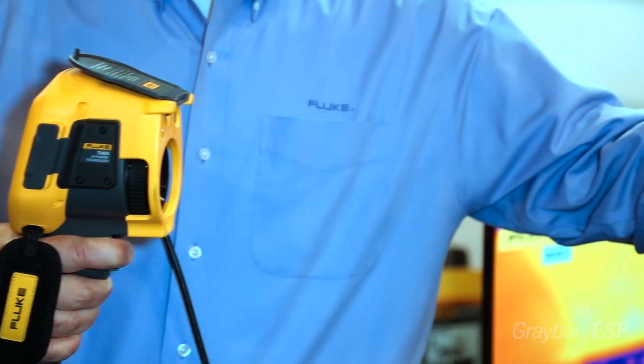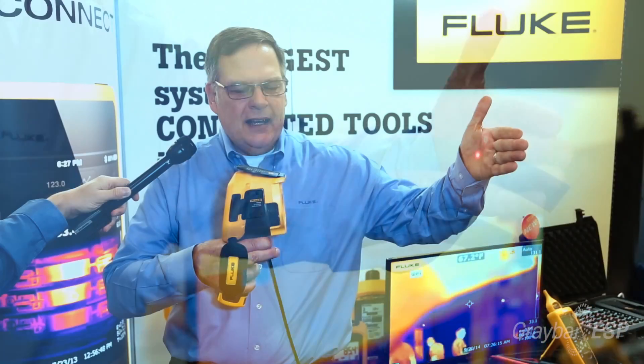With the TI-400, there's a brand new feature called laser sharp autofocus. There's actually a laser distance meter built into the camera. I can shine this on my hand and we'll get a perfectly in-focus image, because it's measuring the distance from the camera to my hand and automatically adjusting the focus immediately based on that.